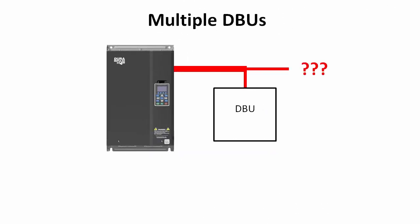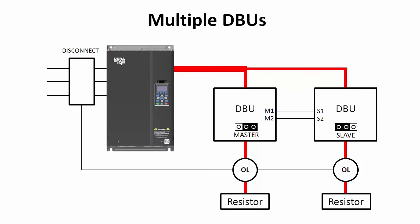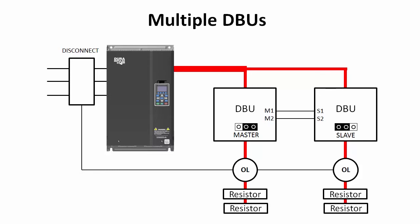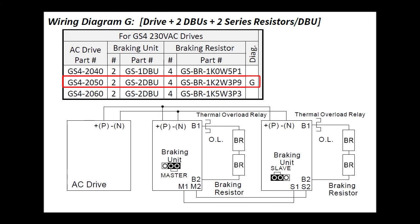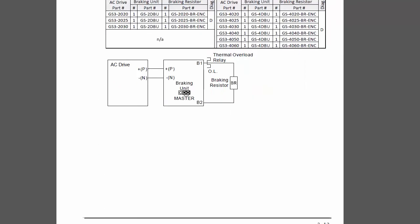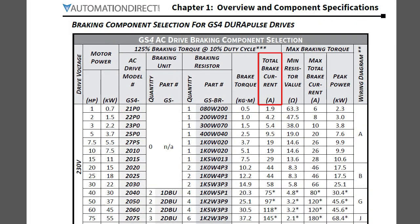The dynamic braking units aren't large enough to handle the largest loads by themselves. In that case, you can use multiple DBUs wired in parallel. Wire the master terminals to the slave terminals, set the first DBU to be the master and the others to be slaves using the jumper on the DBU, and wire the normally closed thermal overloads in series back to the line voltage disconnect contactor. Use the table in the user manual to determine how many DBUs and resistors of which type are needed, wired according to the appropriate diagram. Make sure the total current out of the drive can't exceed the max total brake current shown in the drive user manual, and ensure braking resistors can handle the peak power shown for a duration of at least one second.